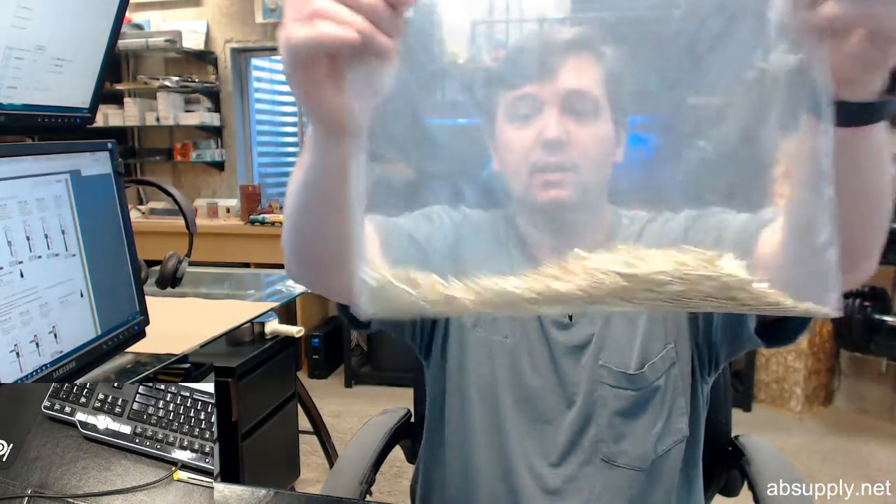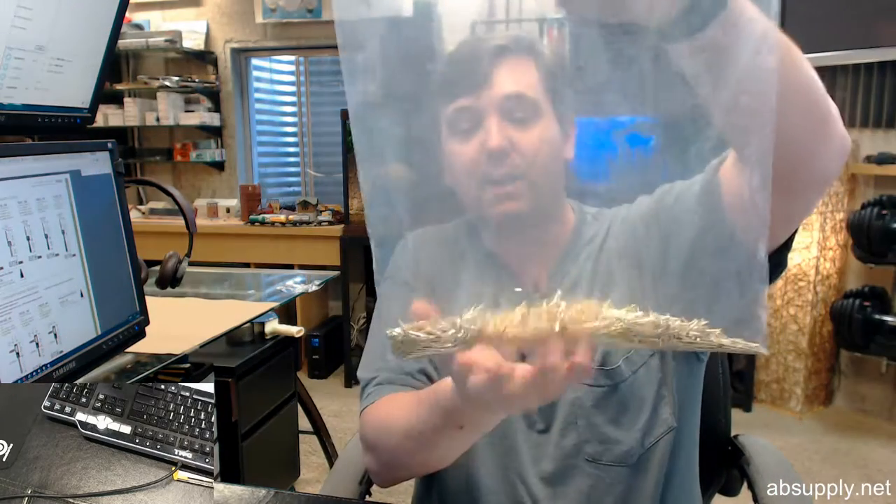So what are you going to use this on? Obviously all the brass weatherstripping from Pemko — their V cushion, their spring bronze material — would be excellent. J hooks as well; if you were doing a B61, that would be a good J hook for an interlocking threshold. The downside is that it's sold in bulk quantity, so hopefully you have a need for several lifetimes of brass plated nails or a job where you need over a thousand pieces.